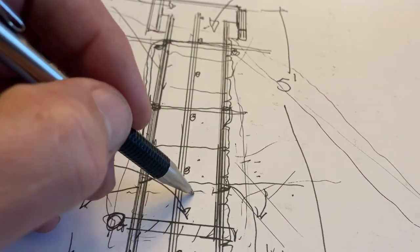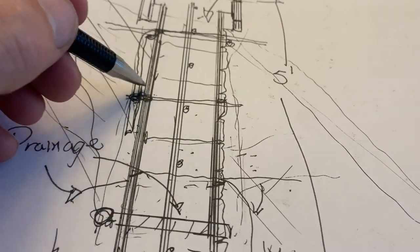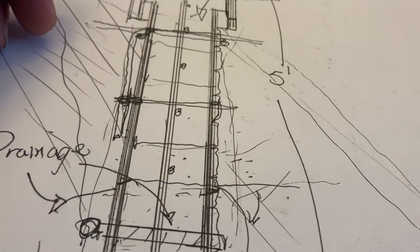Now this will not implode this way or come in because you have these rebar spacers that you put in here on the bottom and the top. And then you can pour into it, leave the rebar in there, it doesn't hurt anything. Anyway, so that's the concept. Two ways of doing it.